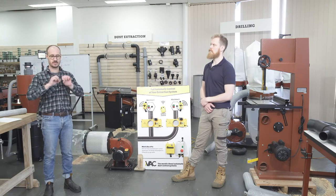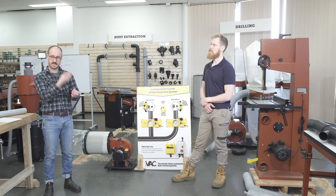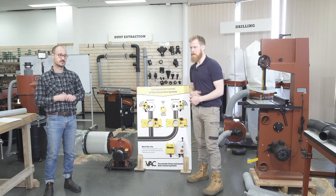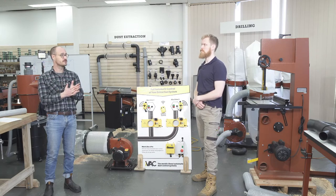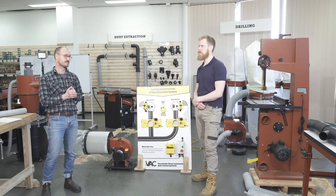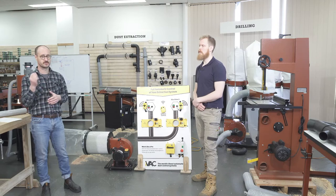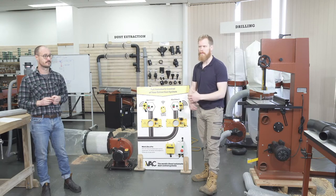They're not going to be thrown to the side of the cyclone and collect in the bottom. They're going to stay in the airflow because they're light enough, and they're going to go through to the filter. I believe that the bigger the cyclone, the smaller the particles. There's some sort of rule of thumb there. But I think MDF is always going to end up, especially with the routing CNC type operation, those particles are very fine.